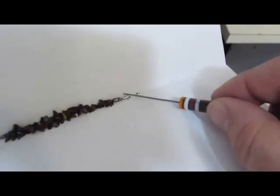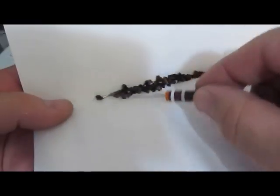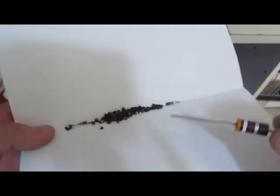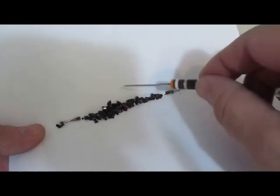To give you an idea of the amount of energy this thing puts out — this is a 470 ohm carbon comp resistor that used to look like a normal resistor. This is what the generator will do to it. You can see the end caps have been blown off both ends. This is why it's good to test this stuff inside a plastic box — there's definitely a little bit of energy here. Don't play with this stuff at home unless you know what you're doing.